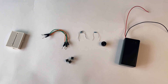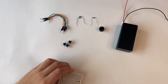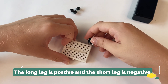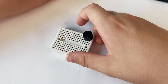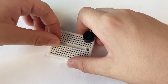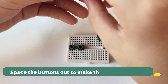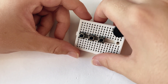Now we're going to make the tritone buzzer. Get a breadboard and place the buzzer with the short negative leg in the very corner. Then get buttons and put one there, one there, and one there, making sure they're all spaced one hole apart.